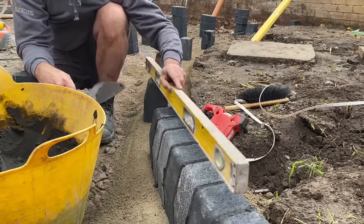Right, okay. Before you whack it, it's important to go round and check there's no stone on the top or any bits of gravel or anything like that. Because if you whack it and that's on it, it's going to scratch the surface. Not too bad on a block like this, which is a rumbled finish, but if you've got something like a dark iron 50 it's going to put a big scratch in it, and that's not good.